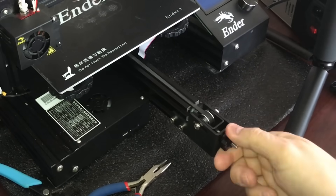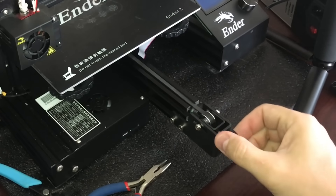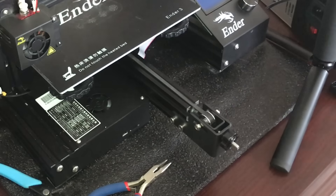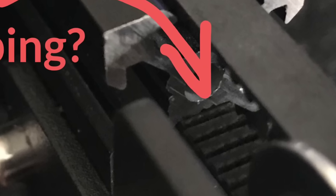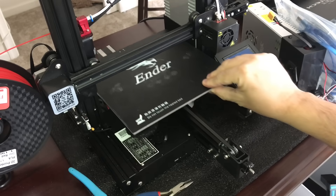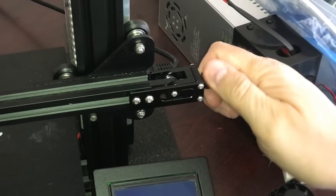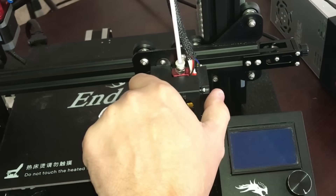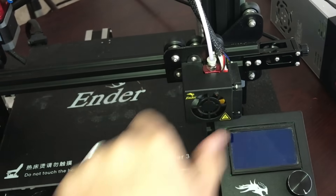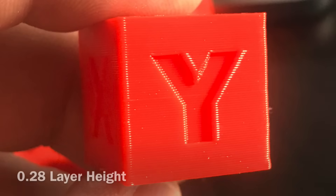So I decided to just crank these things down — tighten to the maximum I could get without risking breaking the belt. This thing was firm, then I backed it off just a touch. I noticed that because of the smaller pulley it was slightly rubbing on the aluminum extrusion, but when I moved the bed I couldn't feel any bumps. On the X-axis I almost ran out of travel space but it tightened up just before I hit the end. The results were very similar to that very first print — super tight but it didn't seem to affect anything negatively.